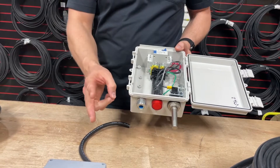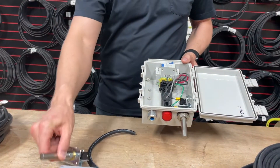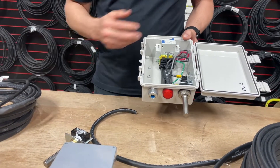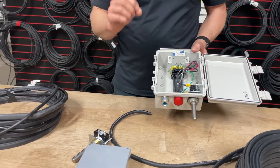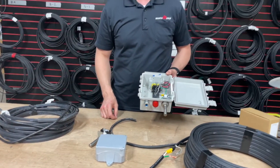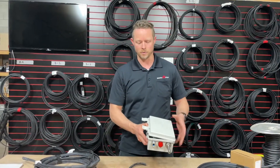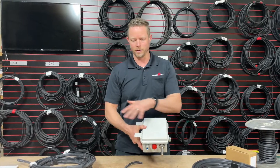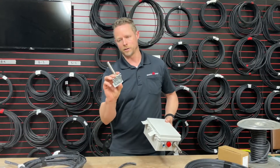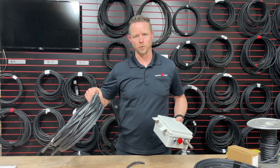You'll have two lines that have to exit the building: one for your thermostat and one for your heat cable. That's all fairly simple once you've seen it done. We'll do some additional videos actually doing this on site on a project sometime, but I hope this is helpful in giving you an idea of how this can work — keeping all the electrical stuff contained inside the building, with just a thermostat probe outside and your heat cable outside with the power cord going through a wall.